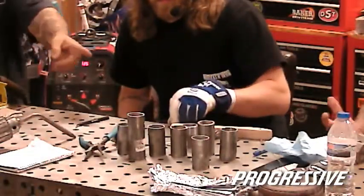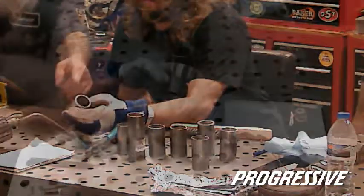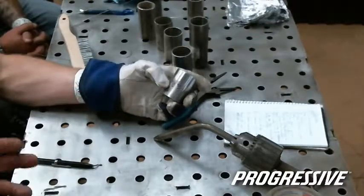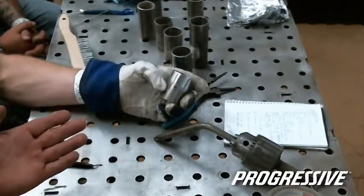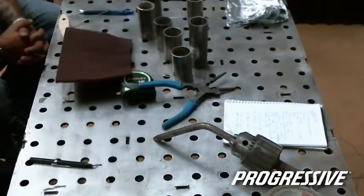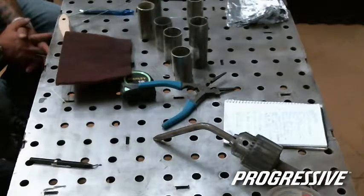And it's actually the difference between the metal itself getting hotter. Look at that. You can see the difference between where he just hit it with the Scotch-Brite. Right here. And then he's going to clean it. You can see how clean it looks now. Then he's going to hit it and clean it up even more. So again, you can't stress enough, especially with stainless and aluminum, that cleanliness factor. It's nuts.